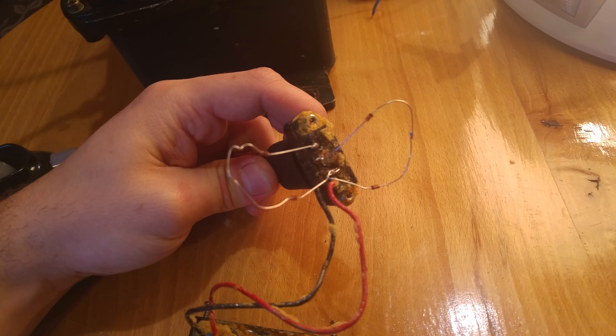I can recommend doing this mod if you're interested in Clansman radios. By the way, those are the diodes I use on the temp sensor, and I recommend using them from one batch so they will have the same parameters and the same voltage drop.